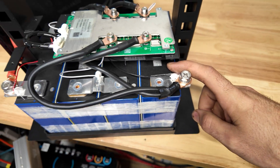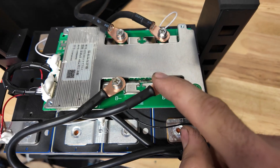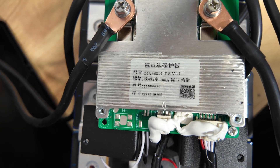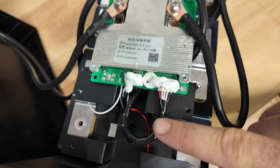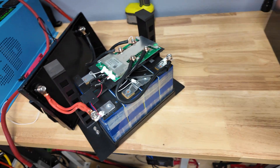There's a visible QR code on there — I'm going to try to get that scanned in a minute. We have nice silicone wires going to the BMS, and that is bolted to the BMS. The BMS is covered with some reinforcing tape, but maybe someone can make out a model number. It does say 100 amp right there. It looks like a pretty generic BMS — not a fancy one. They did put potting compound on the balance harness as well as the temperature sensor.